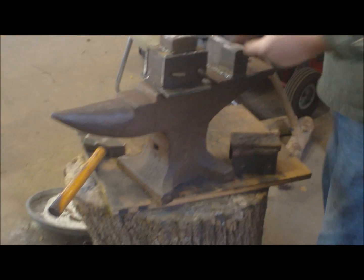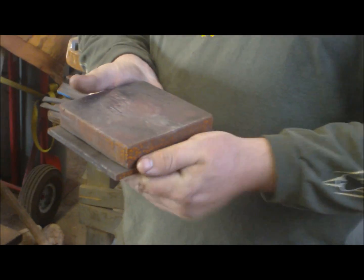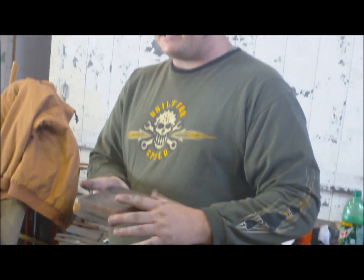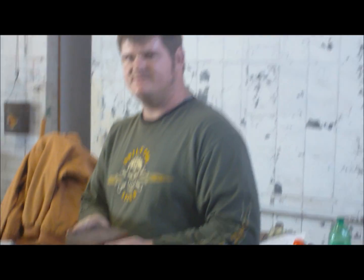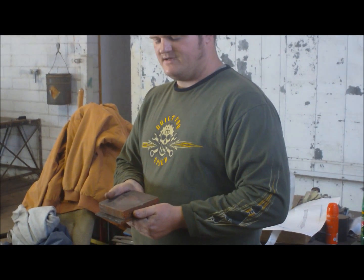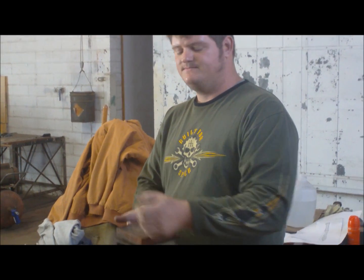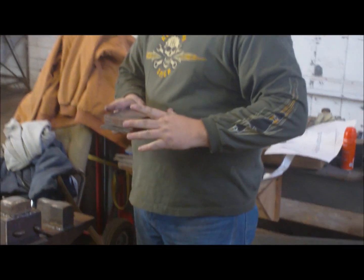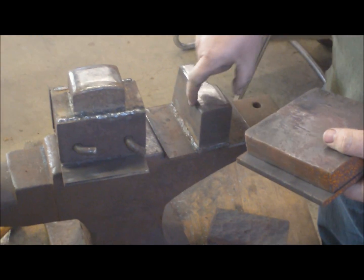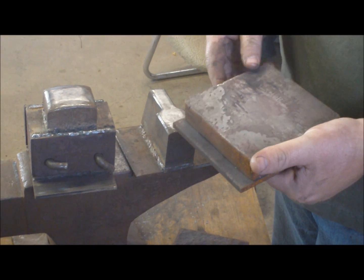This little number is just a plain flat surface — it's mild steel, not hardened. It barely pokes up above the die holder, so if I need maximum clearance I'll slip this into the bottom. I have one for the top as well, which means it's possible to use handheld tooling under my hammer. It gives maximum clearance to have your hot steel and your handheld tool. It's also wider than the other dies, so if I want to hit something without picking up a sharp edge from the bottom die, I can use this — it's similar to hammering on top of an anvil surface by hand.